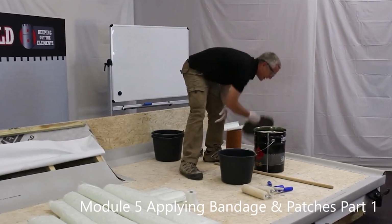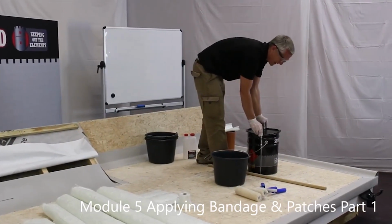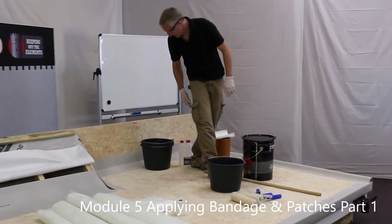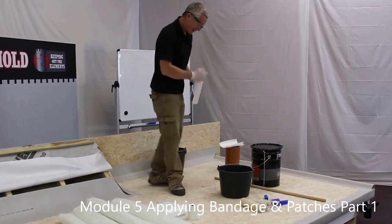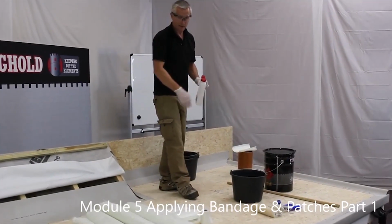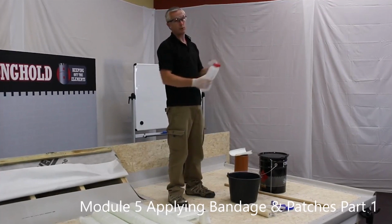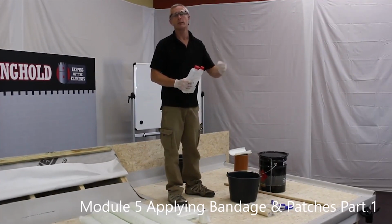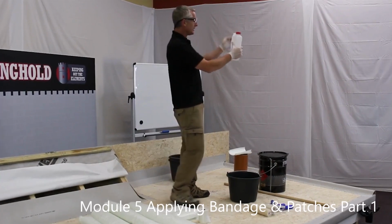Put the lid back on the resin. Bend down 1 or 2 tabs, make it a little bit safer. No, actually I've probably got about 2 litres in there, so I'm going to work on 1%. 2 times 1 is 2. If you add a naught, it becomes 20, and we're looking at using about 20 millilitres.